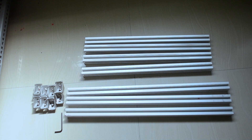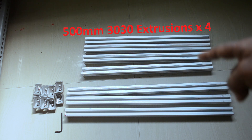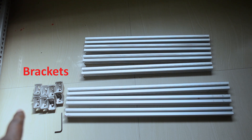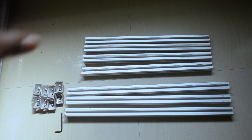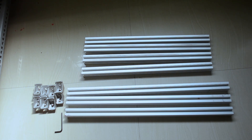We'll now create the main chassis or main structure of the 3D printer. For that we need three 600mm 30x30 extrusions and four 500mm 30x30 extrusions. We also need brackets and an allen key. Using these we will create the main structure of the 3D printer.